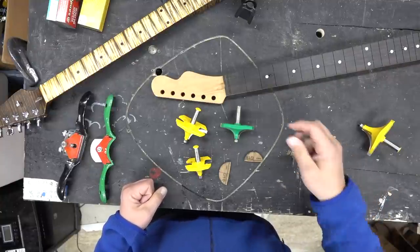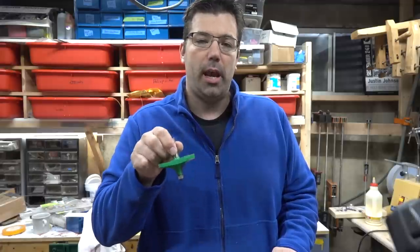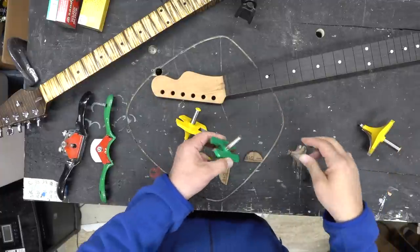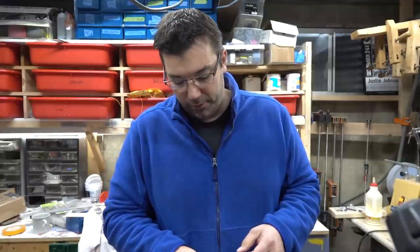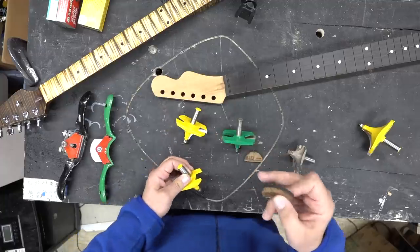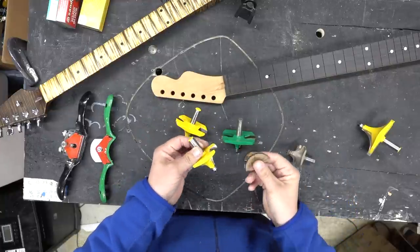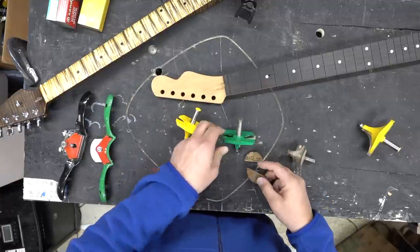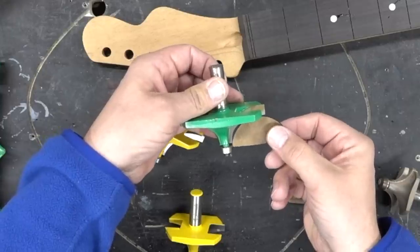Now that I've moved along, I've got a couple different bits that I use. This is a Grizzly Tools handrail bit, and you can see this is more C or U-shaped. As I'm playing around with some of the Les Paul styles, you want that thicker neck 59 profile. These are my 59 profile templates and this is an inch roundover bit — you can see how perfectly that lines up. The Grizzly handrail bit just doesn't look the same.